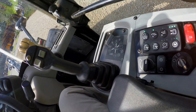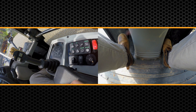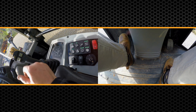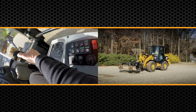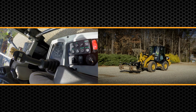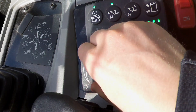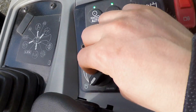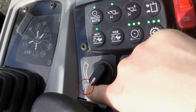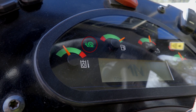To show you this, I'm in neutral and I'm going to go ahead and set my engine speed to ensure that I'm going to get the max hydraulic performance from that work tool. I'm going to activate my work tool using the thumb roller and hitting that top button and then letting go. Now you can see my work tool is rotating. I'm going to turn on my ground speed control to the full position, which is down at the bottom — that's going to be the minimum ground speed. You'll see the green snail pop up on my dash.